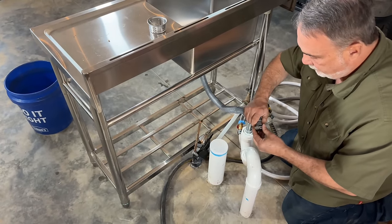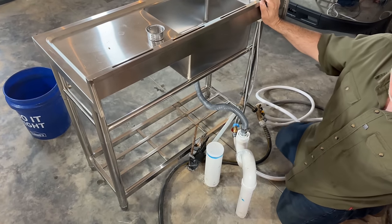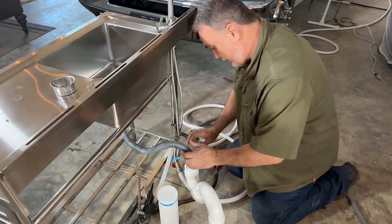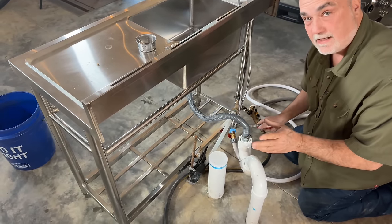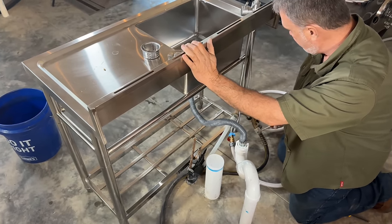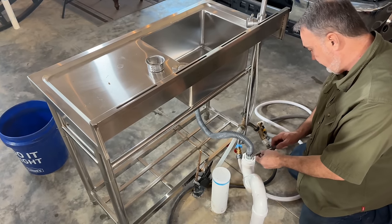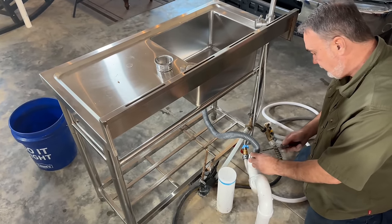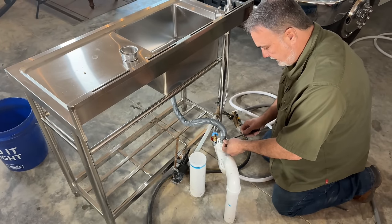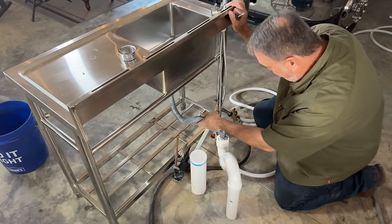This sink can be used in many places — a utility room, a garage, a room where you prep food. A lot of people do canning and this would be perfect for that, even outside on a porch. You can hook this up to your water hose outside — you don't have to plumb your main thing. Just use a splitter on your water hose and run it to cold water. As far as your drain, this is really considered gray water — just washing your hands or whatever — and in certain states you can sometimes run gray water onto the ground.